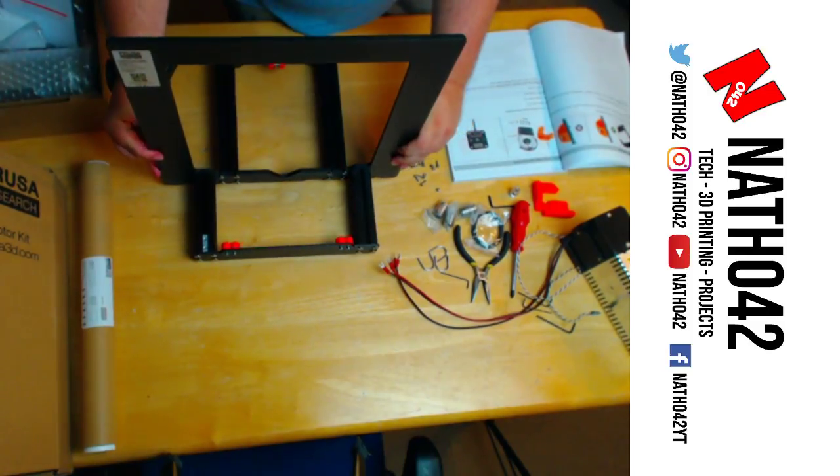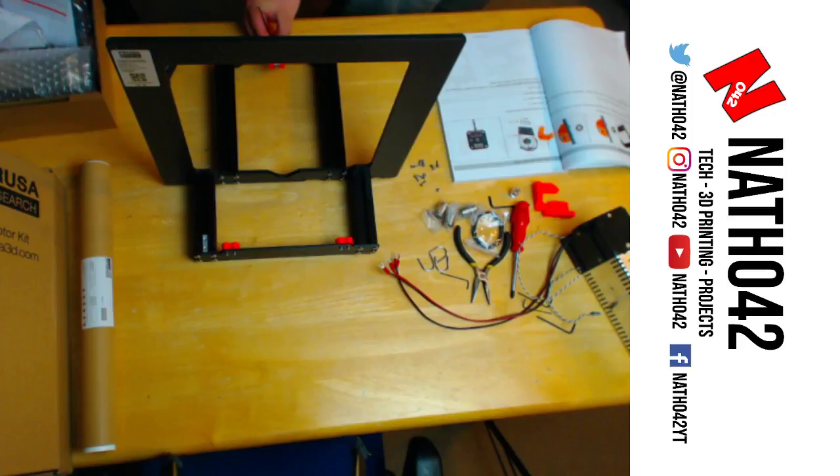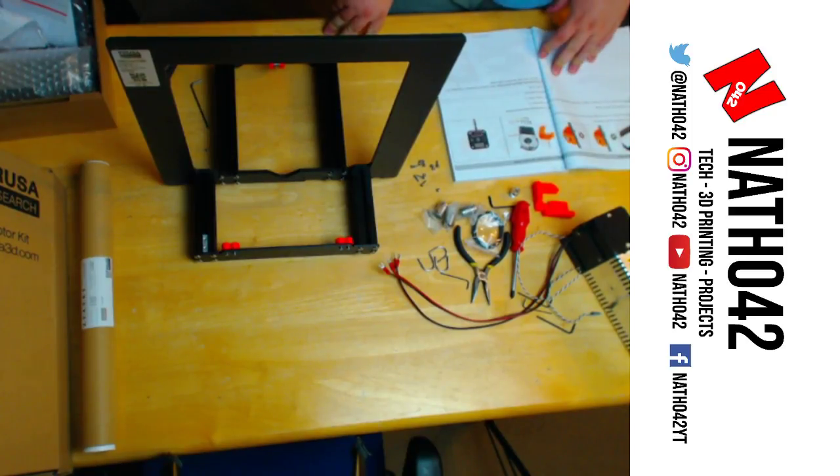Ah, it's slightly longer that way. Because I'm pretty sure in this the belt is flat. The belt is flush with the motor and with this as well. So it causes as little friction as possible. I'm just tightening these up a little bit more. It's probably fine the way it is. It's not moving anywhere. Take the Y belt idler, place it, set that facing up. Secure the Y belt idler with 2 screws. Don't tighten.